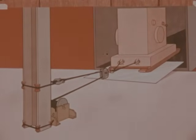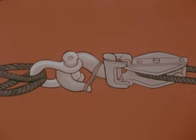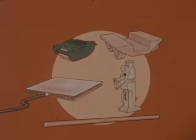The snatch block and winch is especially useful when dry skidding a load from a truck to a loading dock, or when dry skidding a load down a ramp. When a snatch block is used, the hook should have a safety latch or be moused with wire, especially on a side pull as when attached to the load or building column. Safety in moving loads across the floor can be accomplished by selecting the proper equipment, care in its use, good training, common sense, and critical observation while the move is being made.